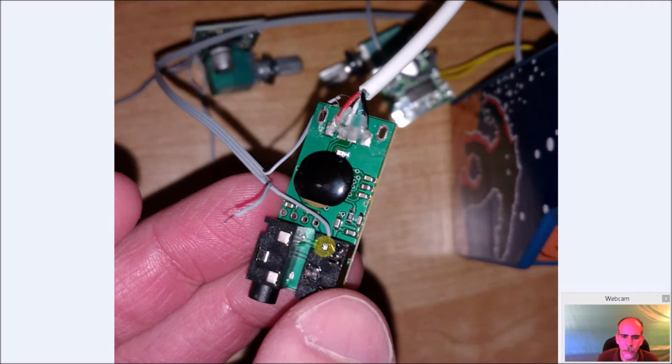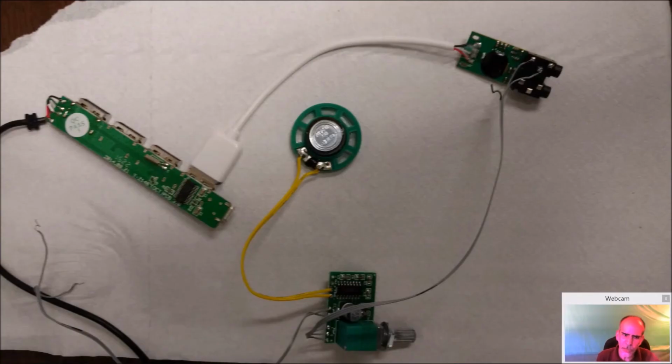And that's really it. Now the reason I did it this way: if the PAM is turned on, you click it and you bring up the volume, you have sound. But if you plug in headphones, you'll get headphones as well as the audio out, in case you want to pump external speakers on. It just gives you an option. And of course, if you turn the volume all the way down and you click it off, you'll only have audio coming out of the headphones. It's just the way I set mine up. And here's basically what it's going to look like.